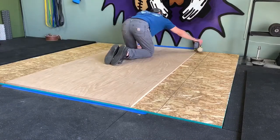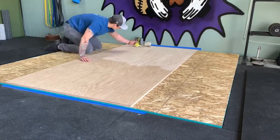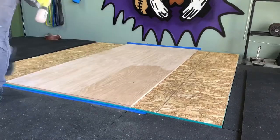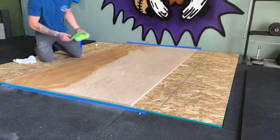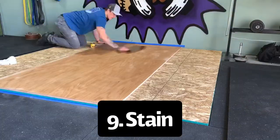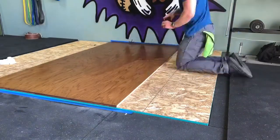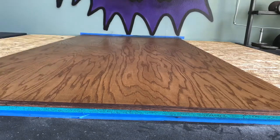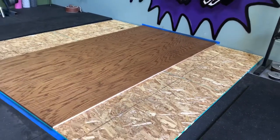But I decided I wanted to sand it down, stain it to make it look nice, and also put a polyurethane coat on it, so that way the sweat could wipe right off and it'd be very easy to clean. Before you stain it, you're going to want to sand it with that 220 grit sandpaper — this will make it a nice, fine, smooth, even finish. Then I went ahead and wiped it down with mineral spirits, which removes all the dust and makes sure that when you apply the stain it really gets in there. Now you're going to apply the stain and get it soaked in. The longer you let it set, the darker it's going to be. I really coated it on there, let it sit for about 15 minutes, and then wiped it down. You really want to make sure that you blend all the splotches in so that way it comes out even and looks good.